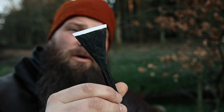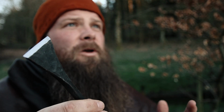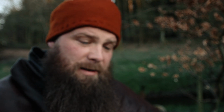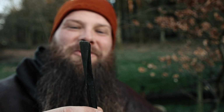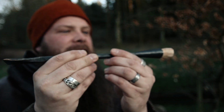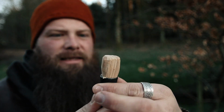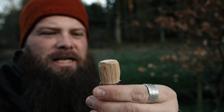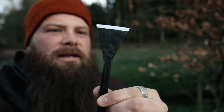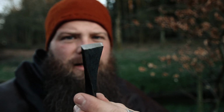This I think will be amazing for paring out and precision work with the new tenons, and when getting a little bit further into the roof construction, I believe this is a fantastic tool as well, and I'm really looking forward to getting to know this fantastic chisel. It's slightly lighter, of course, slightly more elegant in the design. You have, again, the attachment point here, much like a spear tip, I don't know the English word for it, and then a slim shaft, and then tapering out into this beautiful triangular, insanely sharp chisel point here.